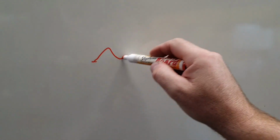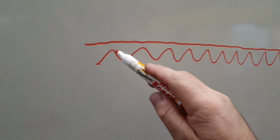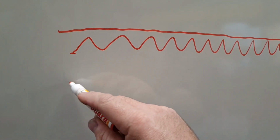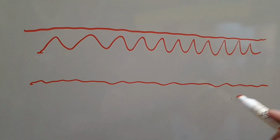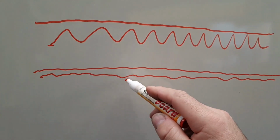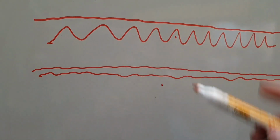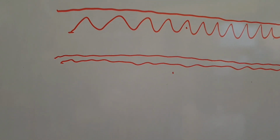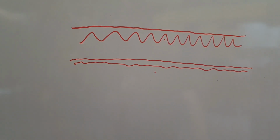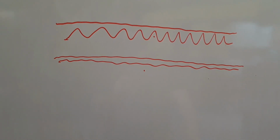If you can imagine you trying to stick something onto a surface that's like this, and you've got something flat with glue on that side of it, you're only going to get certain amounts of contact, not much. And if you scale that down, so you've got perhaps that, which is now polished in a straight line, you'll get far more contact between this and that than what you will that and that. Therefore, a polished surface is better than a rough surface. Taking it to the extremes, if you've got a piece of race tape or duct tape and you try to stick it to, say, the road or some asphalt, you'll find you'll struggle to do that, whereas it'll stick quite nicely to a piece of glass.